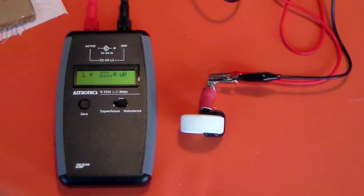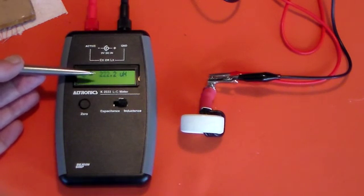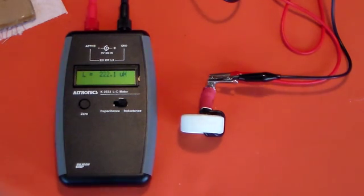Back again. Okay. Wow. I don't know if you can see that. Can you see the difference there? Goodness knows why it produced exactly the same results on my loop. I don't know what your loop is made of, Martin, but maybe yours is doing what it should be and mine isn't. 222.2 microhenries. 222.1 microhenries. That's with that white core.